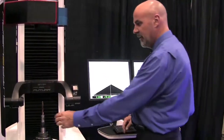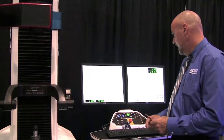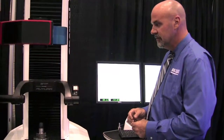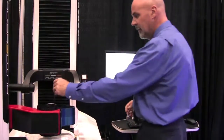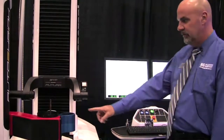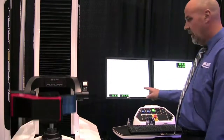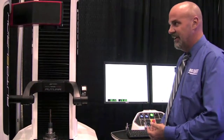It positions the pin down into the holder. Then it's going to drop the coil down. Once the coil is down it'll energize it. When the holder heats up the cutter will drop down to the pin. Then it'll automatically switch to the cooling — so we never have to touch that holder while it's in the hot state.